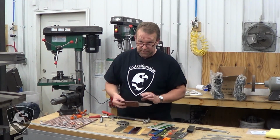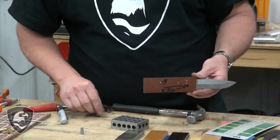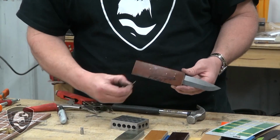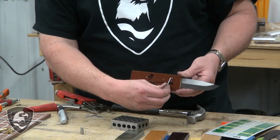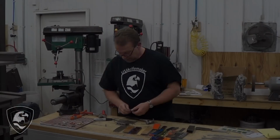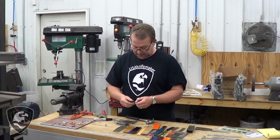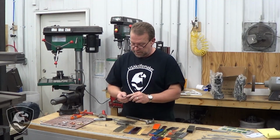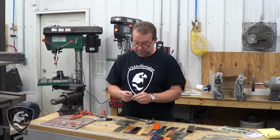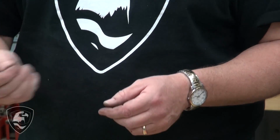So now we're going to disassemble it and countersink 2 holes for Corbies. We're going to put Corby holes right there and there, and then we're going to leave pins up front so you can see both techniques. Now on this particular size with these micro Corbies, that's our name, the major diameter, the larger diameter, is 0.120. So that's going to call for a 1/8 drill bit, which is 125 thou.